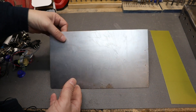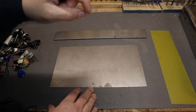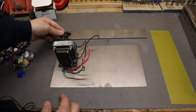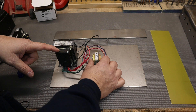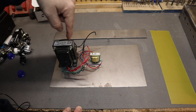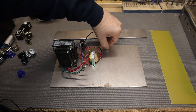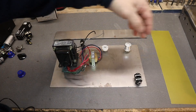Now let's do our component layout. If you don't want to build your own chassis, you can put this into a Hammond box — I'll link the appropriate one in the description. The power transformer goes over here with the black AC line voltage wires. The output transformer should be as far away from the power transformer as possible to avoid coupling — the worst thing is putting them parallel to each other so the electromagnetic fields couple. Always orient the power transformer and output transformer 90 degrees from each other. The fuse holder goes here, and we'll put the power tube socket and preamp tube in their respective positions.